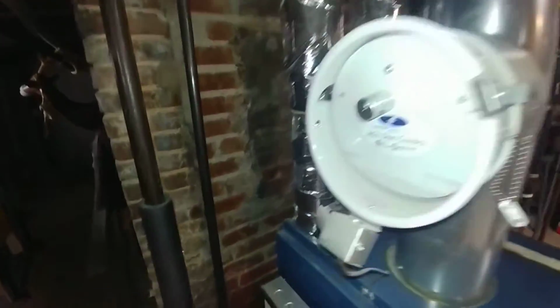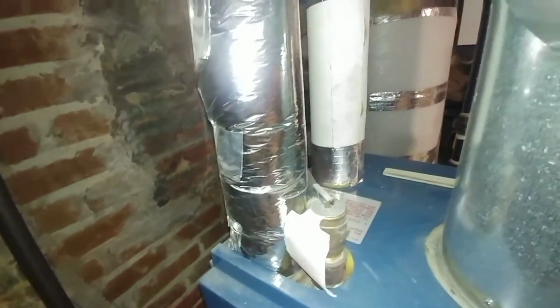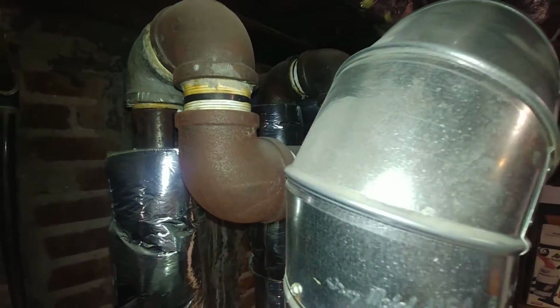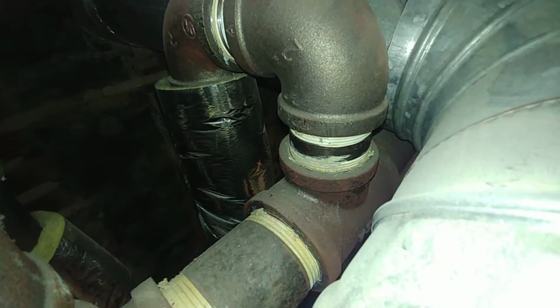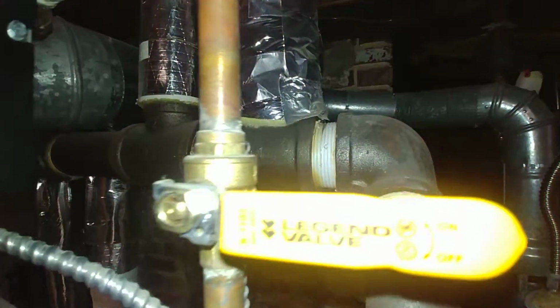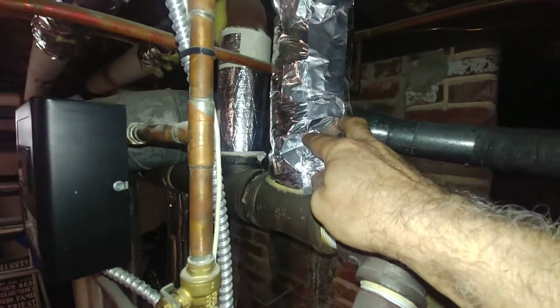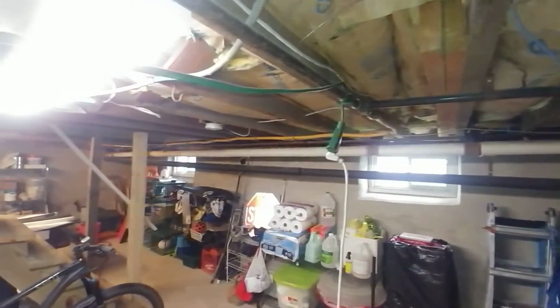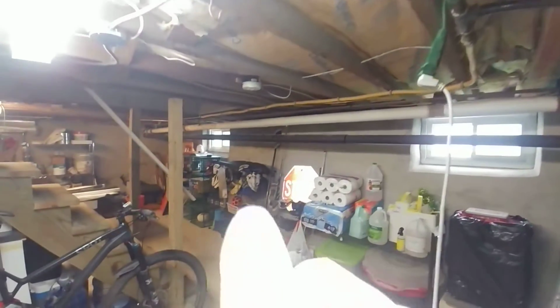And what we've got here is we're using both outlets, 2-inch, coming up fairly high, and going into a drop header, and going into a 2.5-inch header. And we've got a one takeoff here, which goes to the rear of the building. Pardon the glare there.